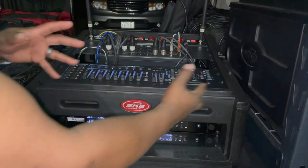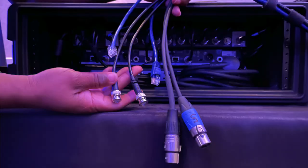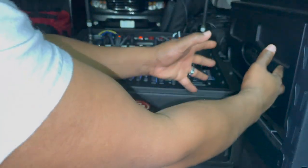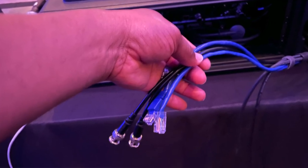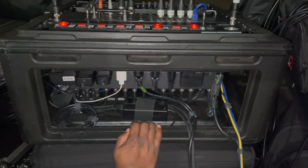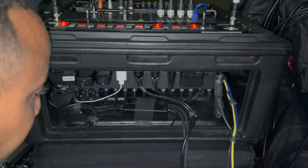As part of preparation for next week I'm going to flip this around because the antenna distro has four sets of antennas for up to four microphones, but it also has a fifth set of outputs used to daisy-chain over to another antenna distro. For next week when I set a mic rack next to this one, I'll be able to provide antenna power for the other rack without having more antennas sticking up. I'm also going to run two more cat5 cables out of this router over to the other two microphones — there's a specific harness built for that already set up. In the back of the Kraken I've got the power cable and two network cables — one feeds the switch, one feeds my mixer — and a port for up to two more cat5 cables going to those additional microphones.